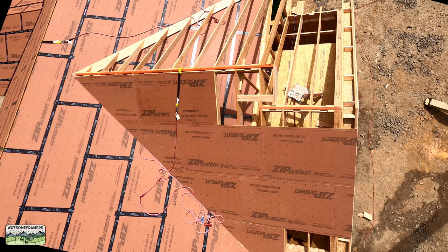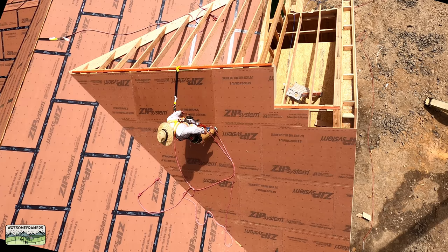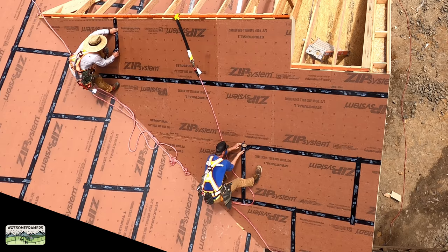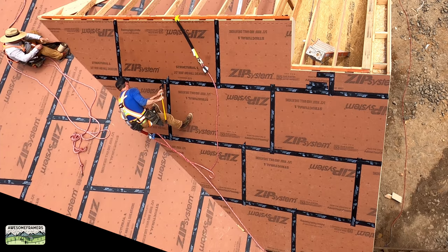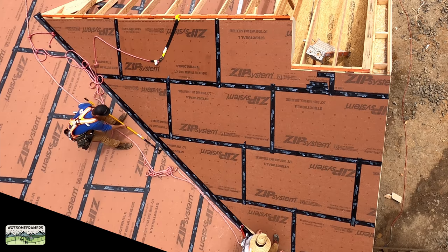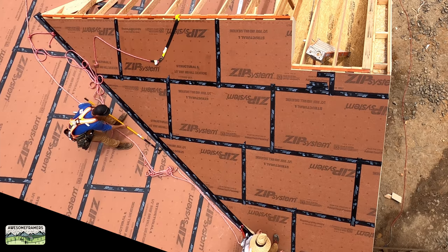Knowing the math makes this go really fast when your cut guy only needs one number, not a series of numbers. The other advantage is when you have a little piece at the top, you have reference points so you know it'll be cut right, and you use up the scrap as you go. This is Zip Roof, which means we tape the seams — it doesn't matter if you start at the top or bottom because it's self-terminating flashing; just remember to roll the tape. Kyle rolls the field tape while I use the six-inch tape out the valley, and that's it.